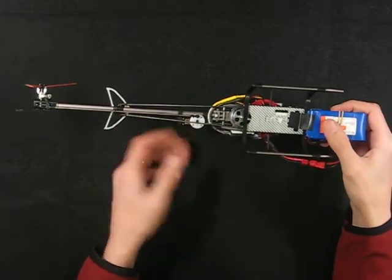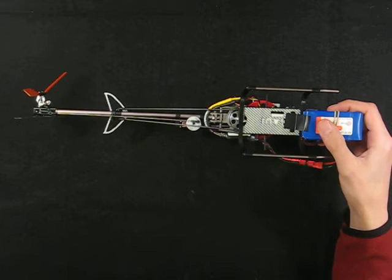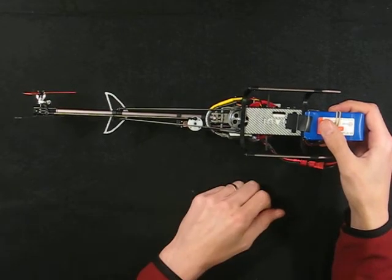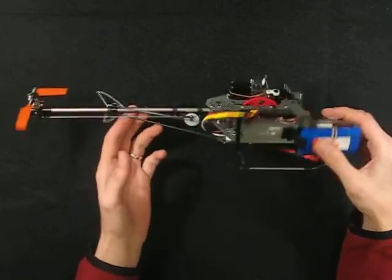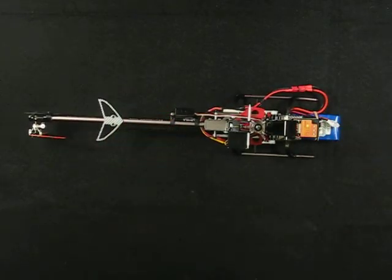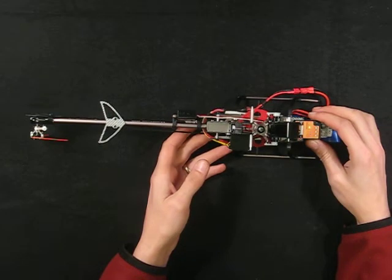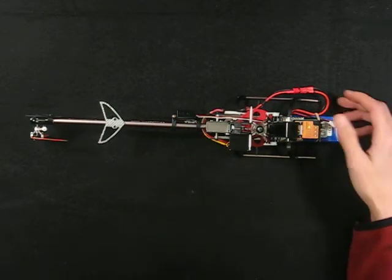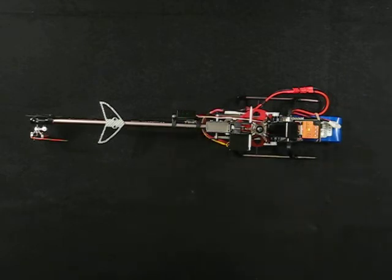But the point here is that you can leave this at this setting as long as you want to. The servo is just going to lock into its center pulse. If you were to change, you would push the servo to a different center pulse depending on what else is there. For us, this particular one wants to use a 1520 center pulse, and so that's where we're going to leave it at 1520. That's blue on the LED, and so we can move on to the Servo Frequency.